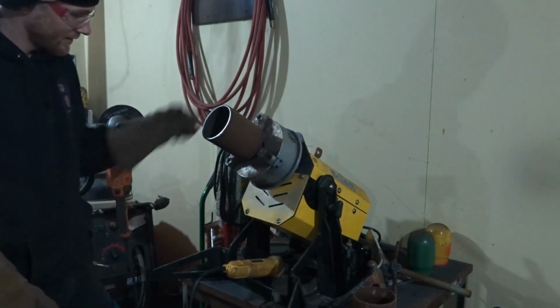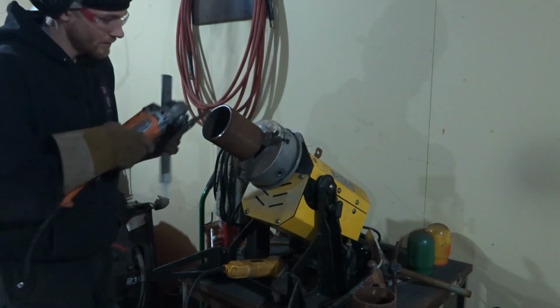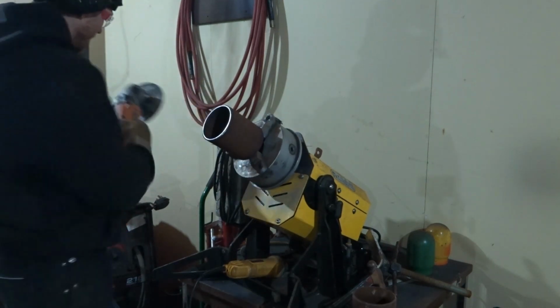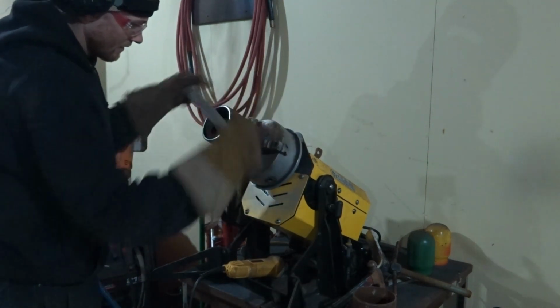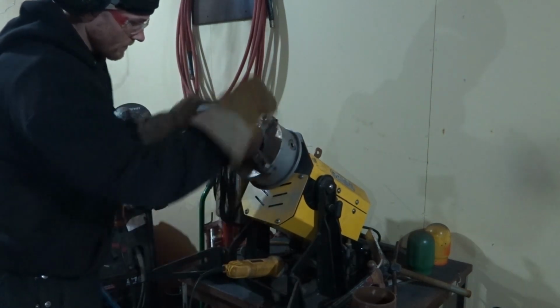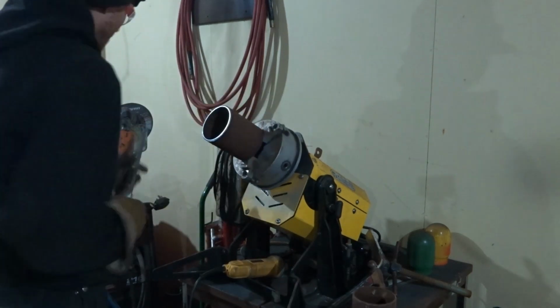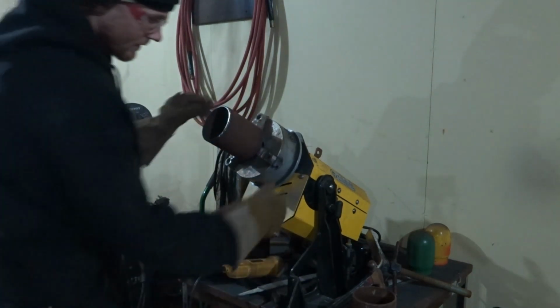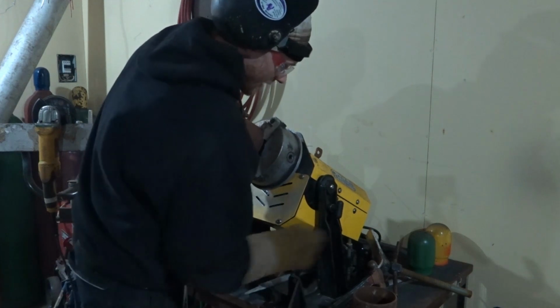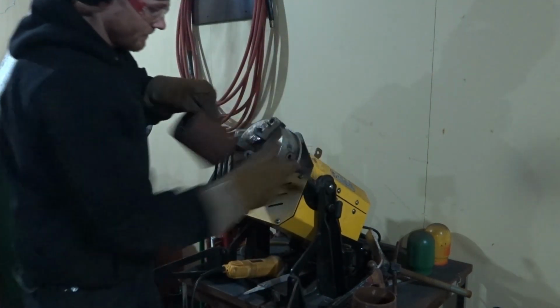See, so I got my 1/16 land on there, it's all nice land, everything. I want to make it, when you go over the grinder, the grinder makes it all square. So go over it like this, now it's going to round all your bevels there. Okay, now it's all a nice 1/16 land. I got a nice bevel on here.